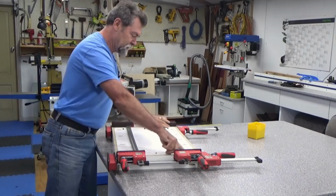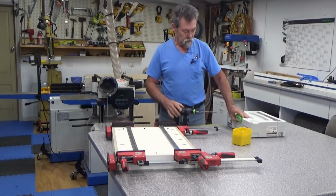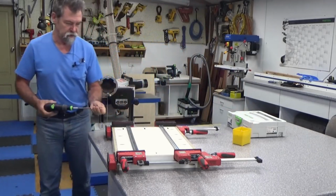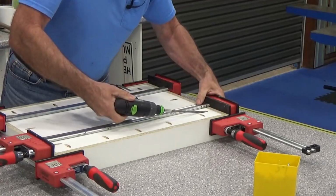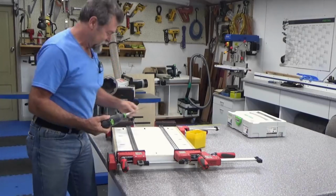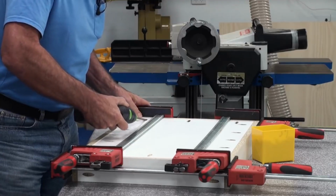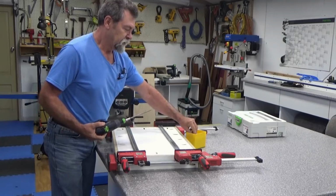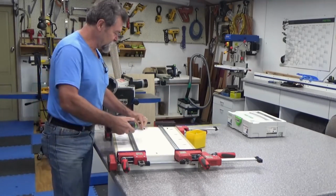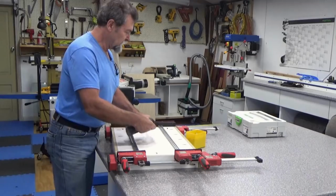So I can now screw those, and we're set to number 4 on the clutch, and they're 1-inch coarse washer heads. Done. How easy. I love it. So easy. And these are extremely strong. These drawers are very, very strong. You might say, oh, it's only particle board, it should be plywood. Well, it's your call, whatever you want to use. I like using melamine.